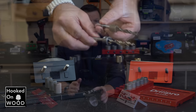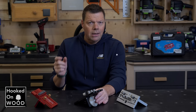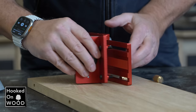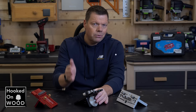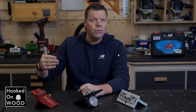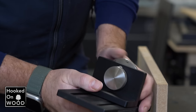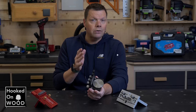In general, we want to place our dowels in the middle of a board — at least we want control over where to place them. Every sophisticated doweling jig has its own method for this. Those that use teeth to lock into place have a resolution of at least 2 mm. The Drill Pro version has a 1 mm shim you can add against the inside of the doweling jig, so by adding or removing it you create a 1 mm resolution. This Renew works basically the same, but instead of a steel shim, it has a fairly advanced wheel that can create a quarter-millimeter resolution.